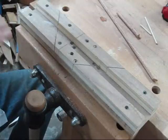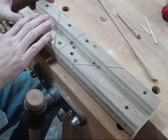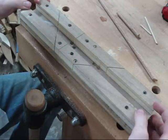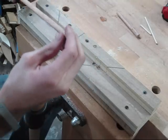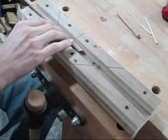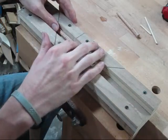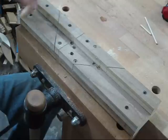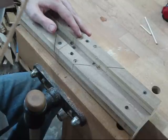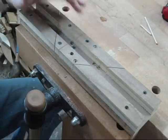A couple of notes: leave yourself enough room so you can put a clamp in there. This one here is kind of tight — it's only an inch gap. But for most little stuff like this you really don't have to clamp. It'll kind of just hold itself in there because the push of the saw will be holding it against the fence. So that's not a big issue. This is just a very, very rough design, but take it into account and maybe make some of your own.